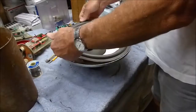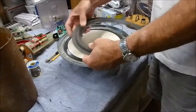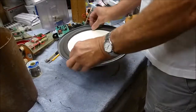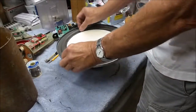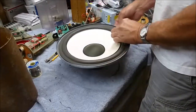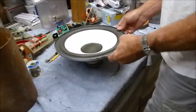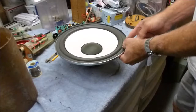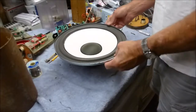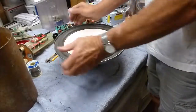Here's the surround I'm using. It's not going to go on the front side of the cone — it has to go on the back side. So you tuck it under here and check the fit. At first glance it looks like it fits, but you can see it can move around quite a bit. When you get it to fit right in one spot, there's actually a gap in another spot. So what I'm going to do is cut the foam right here, cut out a small section, bring it together, and then glue that section on the back to make it a little bit smaller and make it fit properly on the cone.